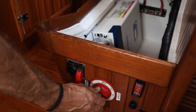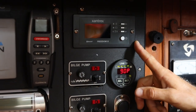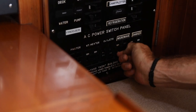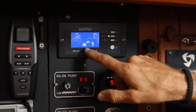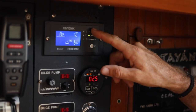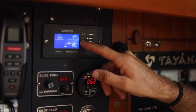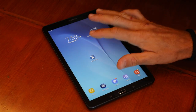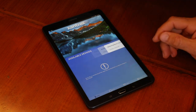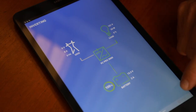Now we're ready to power back up the boat and test the installation. Although the inverter charger has a display on it, we have the remote Bluetooth panel so we'll use that. The inverter is powered up and we can go ahead and turn the AC power back on to the boat. The panel now shows that we are inverting — taking power from our battery bank and inverting to AC. To pair the remote panel, just hold the escape button until you see two horizontal flashing bars, then open Xantrex's FXC Control app, turn on Bluetooth, and select your inverter charger.